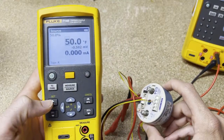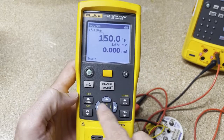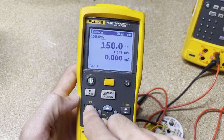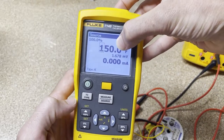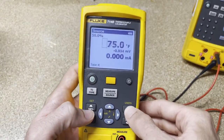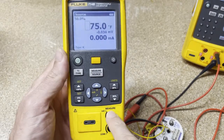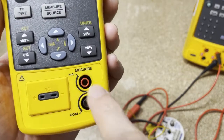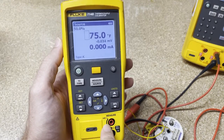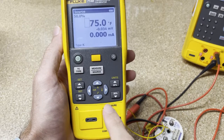In this case it's actually set from zero to 150, so I'll scroll left and right, and up and down to change the numbers. I'm going to set 150 as my 100%. I hit shift and set, and now I'm sourcing 150 degrees Fahrenheit at 100%. Hit zero and it goes to zero; at 50% you can see it's halfway. One important thing to note: we can only measure milliamps with this tool — you are not going to be able to source milliamps. If you need to source 4–20mA, you need to look at other tools like Fluke's multi-function process calibrators or loop generators.